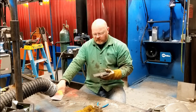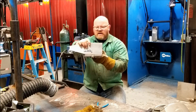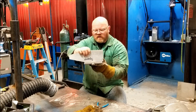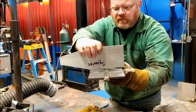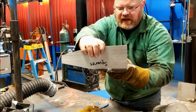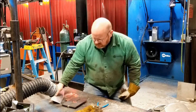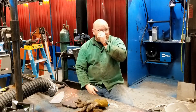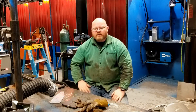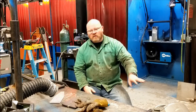Now that we've got this ground, let's take a peek at it. I've got a relatively straight part. Hopefully you can see from the camera — this is flat. That is flat. Across the end, again, it is flat. I might have a slight, slight depression in the opposite direction. But I would argue that that's much better than what would have happened had we not fit this with a little bit of pre-camber. This is not something that's going to work every time — none of the individual techniques alone will work every time — but it's a tool to have in your toolbox.